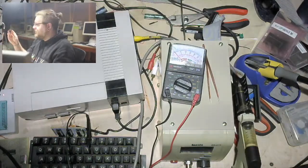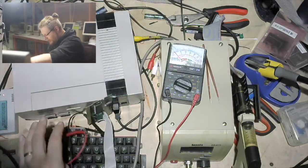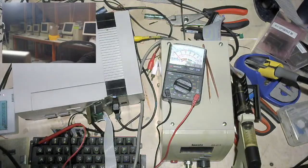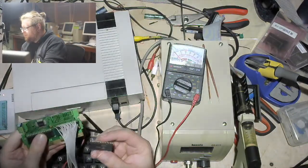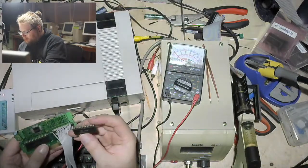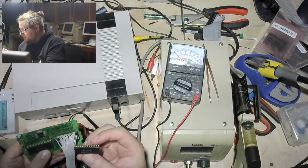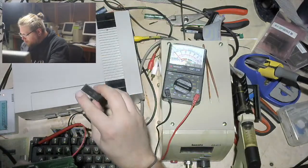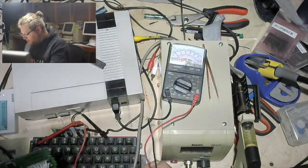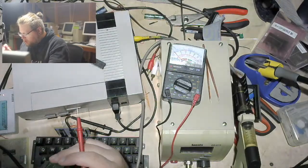So even if I did break this, I think any suitable normal EEPROM will do, because this is now on the floor. Firstly, the board has narrow and wide footprints, and it's not like a specially branded part. Like these mask ROMs are specially branded, but this just says NEC. Looks like a standard chip. Anyway, boy, I sure did trace out where chip select was and then just not make note of it in any significant way.